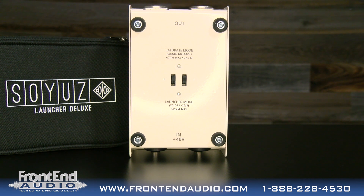In the bottom position, you are in Launcher mode, so you're going to get 26 dB of gain — but not clean gain. You're going to get color, tone, and character. This is going to bring your interface and cheap microphones to life and add some cool character. If you want to not have that gain boost — because maybe you're using a condenser or an active mic — you can put this into the top position, which means you're in Saturate mode, so you get that color and character without all the unnecessary extra gain.